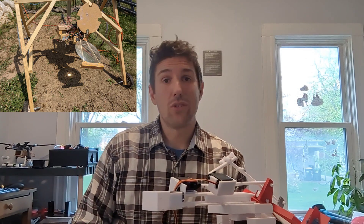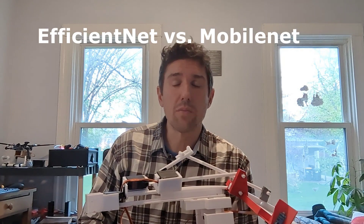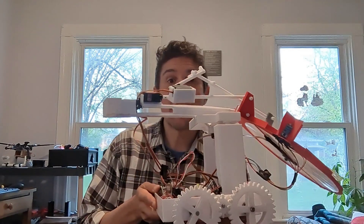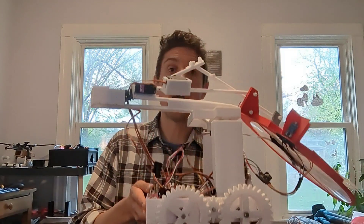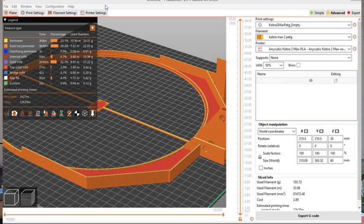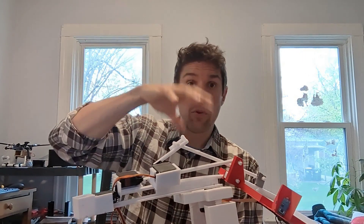So there you have it. Comparing it to the previous version, it's a lot smaller and cheaper. There's better control because the weight of the lens is counterbalanced, so we're not putting all that weight directly on the servo motors. We're doing better image classification — the models have gotten better and compute speed is a little higher. Most importantly compared to the previous model, this can actually be replicated. The previous one was built by hand and you had to customize the code every time, but this is 3D printed. Even if you don't have a printer, the 3D models are out there with measurements, and the assembly is standard — you don't have to customize the code to get your version running.